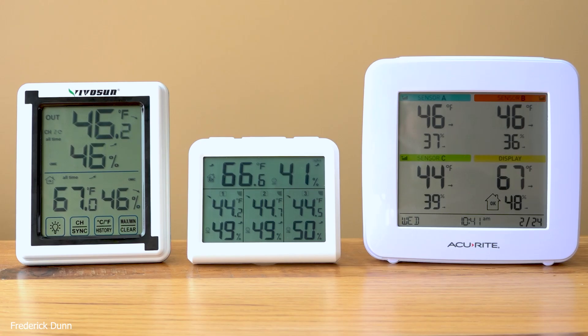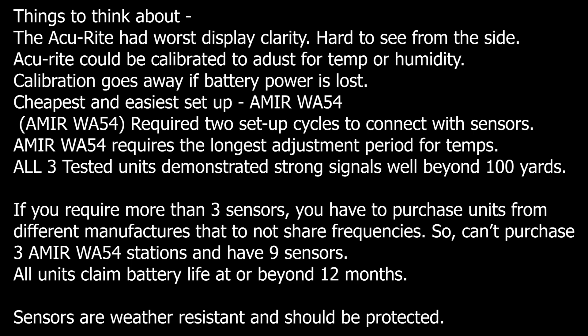Humidity level averages were 36.5, 36.75, and 33.25 — the Accu-Rite actually read the lowest humidity. Unfortunately I didn't have a calibrated humidity gauge to validate that, but the point is they're all pretty similar to one another. Temperature ranges were 67, 66, and 67 degrees. The humidity ranges were okay, not super tight — but remember the Accu-Rite can be adjusted. If you can take it somewhere with a calibrated environment, you can calibrate it right there and bring it home. For me, these will show trends: increased humidity, increased temperature — if it hits 50 degrees or above, I know my bees can get up there and access emergency stores in the feeder shim. Thanks for watching, I hope this helped you make a decision.